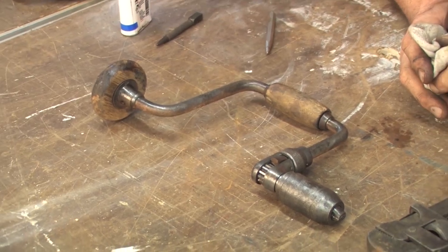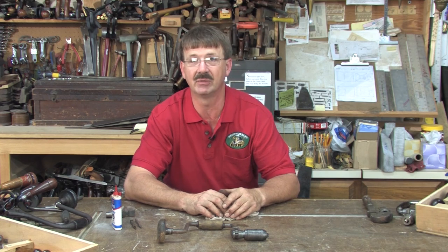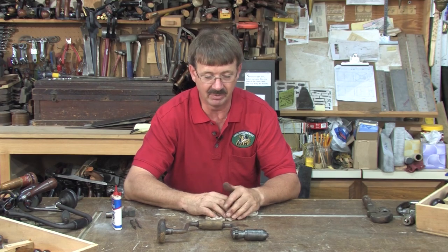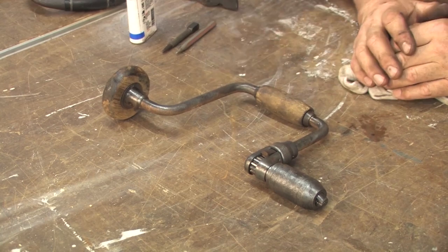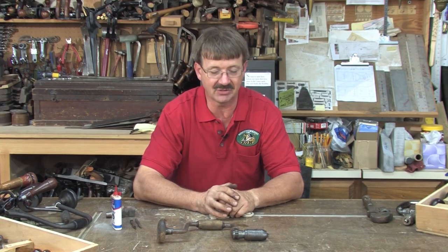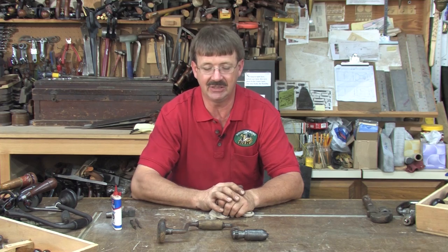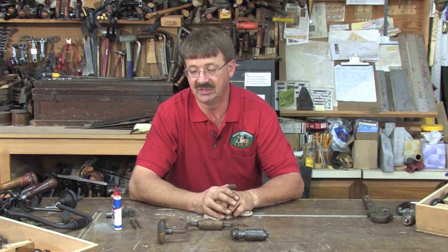Take another 20 minutes to finish the other side on the wire wheel. As I was working this, the name Stanley came up on the side of it, so now I'm halfway to identifying what it is. The fact that it's got the name Stanley on it, I know I've got some halfway decent quality here. This brace looks like whoever owned it either had the auger stuck in the wood and used a pipe wrench to get it out, or they were trying to cut through something thick and added a wrench to the shell to turn it. The shells are pretty minor — it's a good thing they didn't crack it. If you're just a casual woodworker and somebody gave you a brace free and you were able to do this work to it, you're ahead of the game. This may be the only brace you'll ever need in your life, and you can bring it back to life.